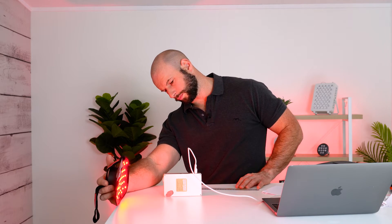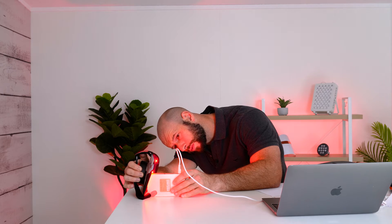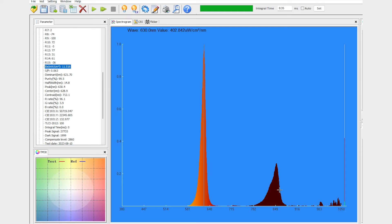Now I'm going to fire up the spectrometer and see what wavelengths and how much power is coming from the LumaFlex. Looking at the spectrometer data, we can see there are two wavelengths. The first peak is coming in right at 630 nanometers and the second one is at 851.52 nanometers, which pretty much aligns with what they're claiming on the website — always a good thing. Interestingly, there is a lot more red light than near-infrared light in this graph, so it's definitely more of a red light device than a near-infrared one — not the 50/50 split we typically see in an LED panel, though that's not necessarily good or bad.